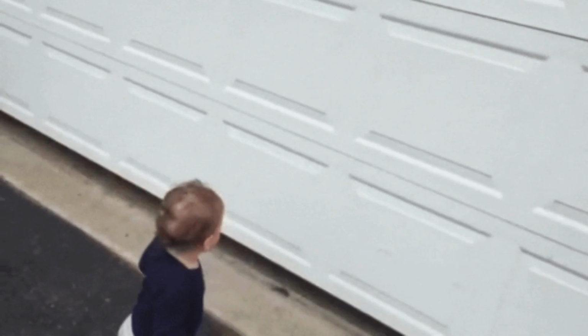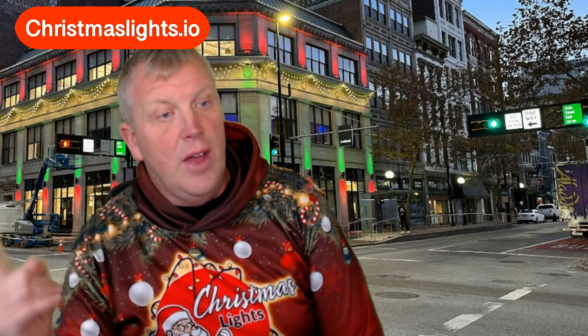It might be right where the plug is. It might not be. It might be on the back side of the house. It could be on another plug of the house, which could be causing all those plugs to drop off of one GFCI anywhere along there. In a lot of newer houses, the GFCI will be right inside the door. That one GFCI will control all the other ones, so if it pops, it will control all of those other ones too.